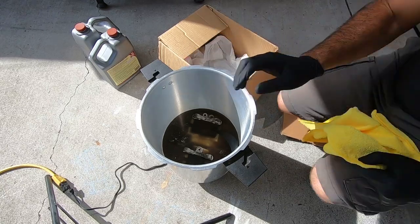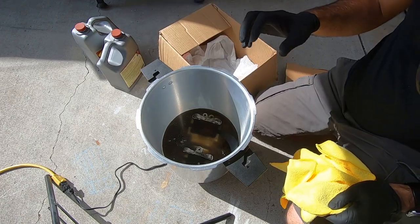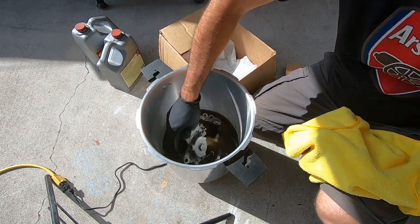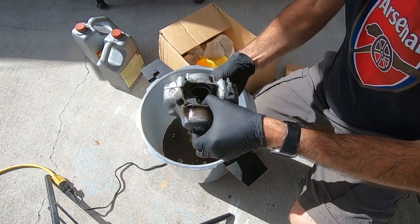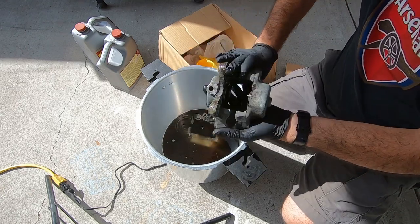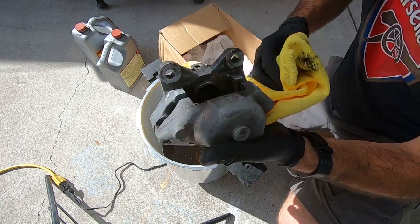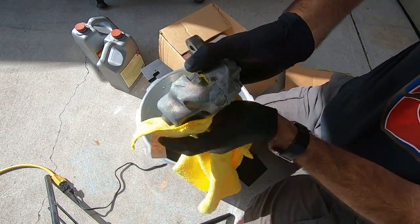Got my gloves on and I'm ready to take it out. If you actually read the instructions, it says it has some detergents that take off grease so it can work on the metal. Part of what happens is the detergent scrubs the metal, and then the second part is you're supposed to wipe it off right away. It doesn't say it won't allow it to rust again, but it does leave a kind of film on the surface. It does say to dry up and get all the vapor rust off. You can see there's definitely no rust anymore, but there's a lot of fluid down in all the little cracks and crevices.